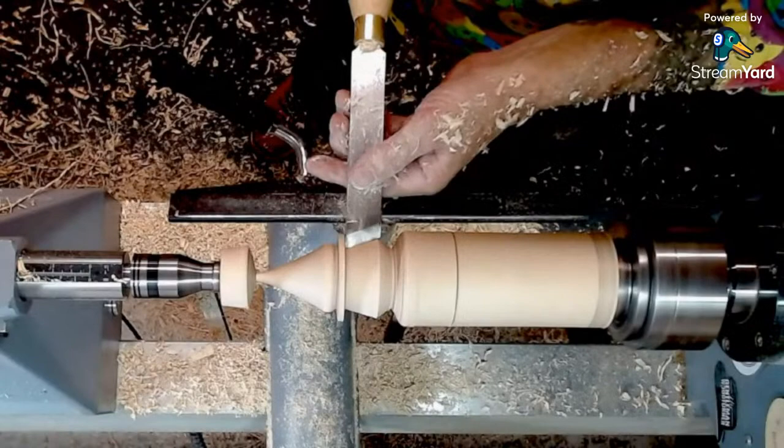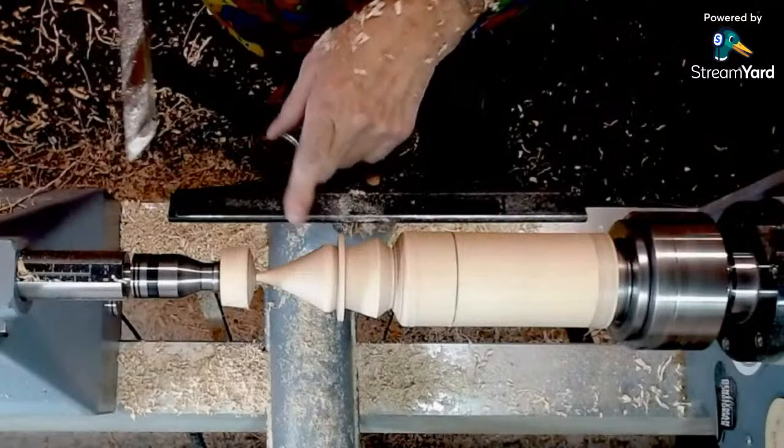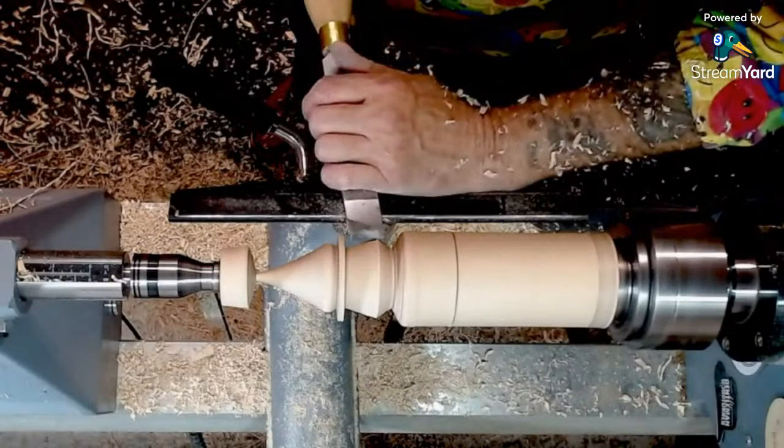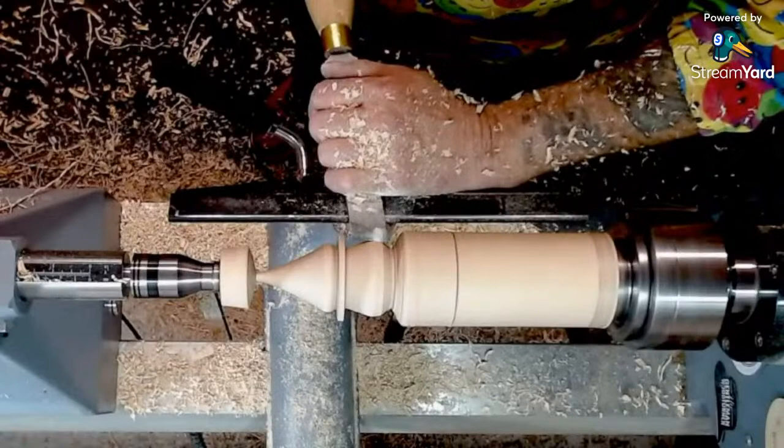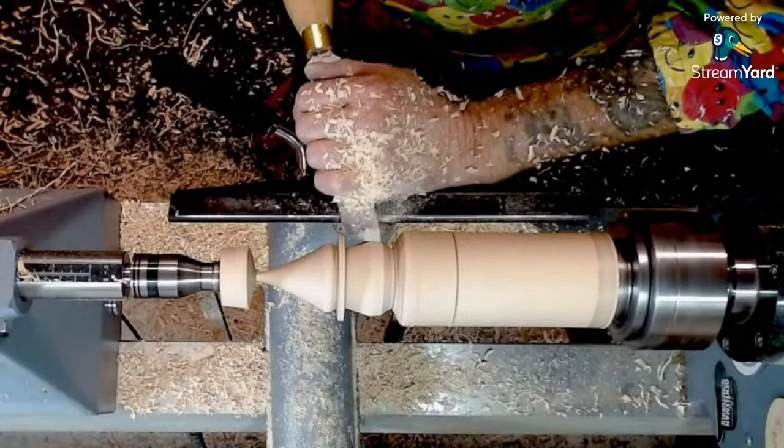Now you're going to turn your lip. Turn your skew over. Now turn the skew over and do what? Straight in. Make it straight. Make it all one side. It comes from the hat to the transition point. Just plunge in now. Your cheeks come straight down. Your head comes straight down. You only get a chin afterwards. Is that what you mean? Just flatten it out. Just make it parallel all the way down.